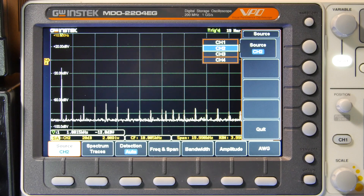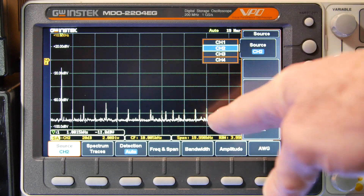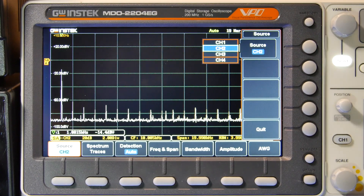I moved the Keithley THD meter over to the input with the power and everything running, and it's reading about 0.076%. But I turned off power to hook up the Keithley, and if we drop the supply rails down to zero volts — it takes a while because it's averaging — but the THD goes all the way down to 0.001%. So the generator is pretty clean. It looks like my lab power supply is actually adding some noise, which tells us that when we hook up our real power supply we've got to be careful not to put noise in.